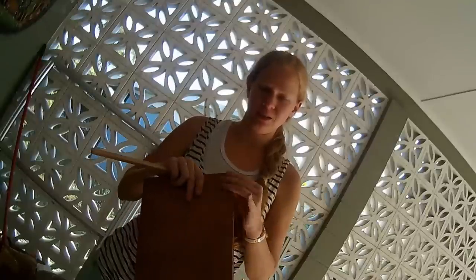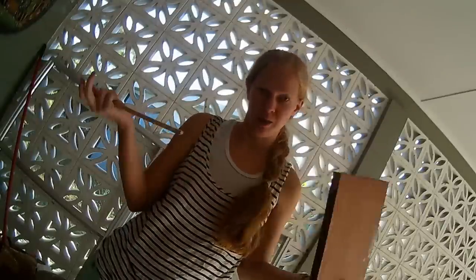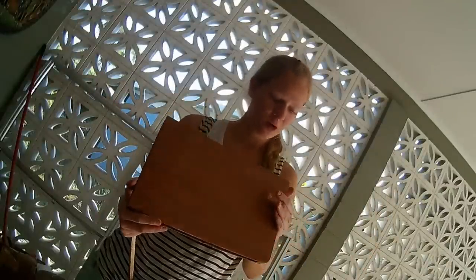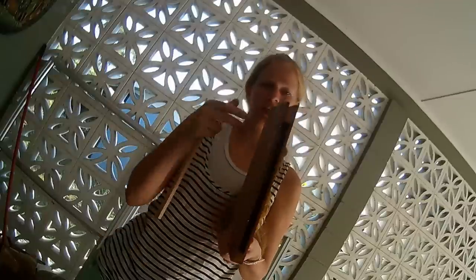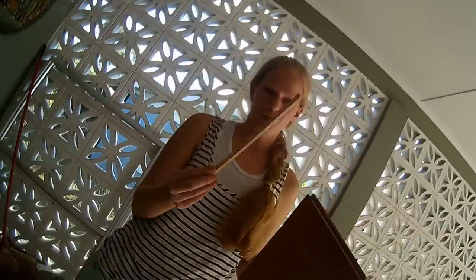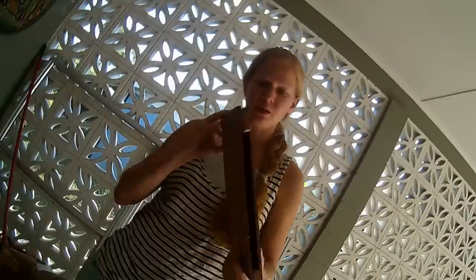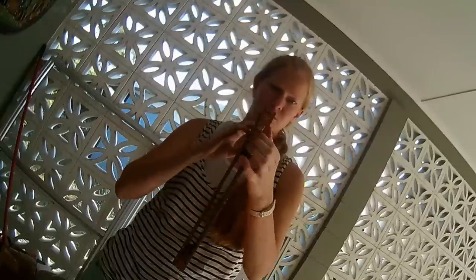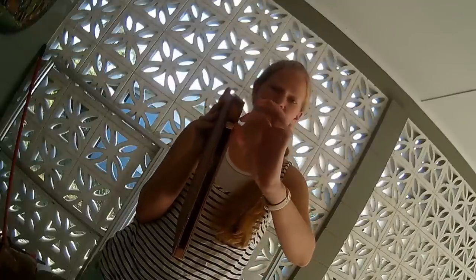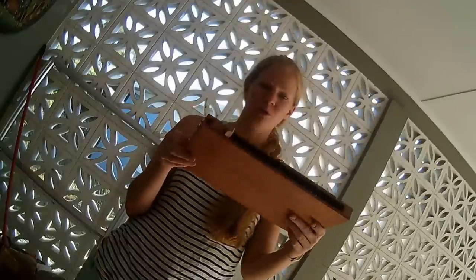Not only is this dagger board and the other sailing pieces still tacky because I mixed the epoxy wrong, so I'm gonna have to sand it down and put another coat of unthickened epoxy on it, but it's too wide this way. The dagger board fits in it, but it doesn't fit tightly in it, so I made up this shim with some 9mm plywood. I'm gonna epoxy that really well, and that's gonna go here. Then we're gonna be able to trim this down. Actually, it's gonna make our seat maybe an inch narrower, which gives us more leg room and more room to sit on the floor when I'm sailing.